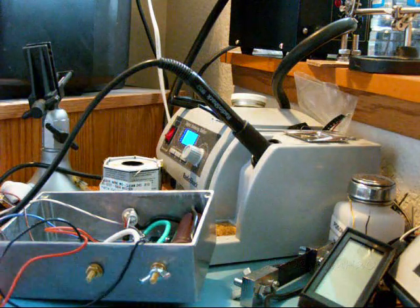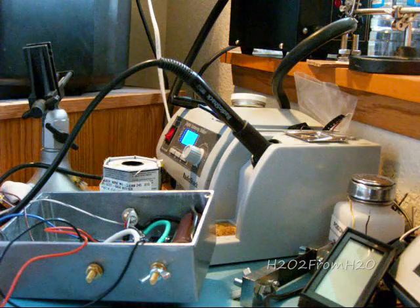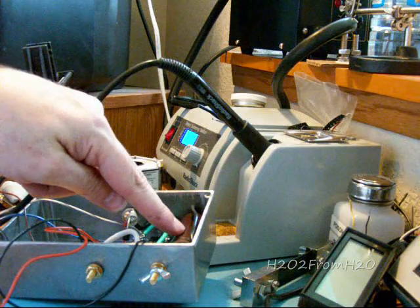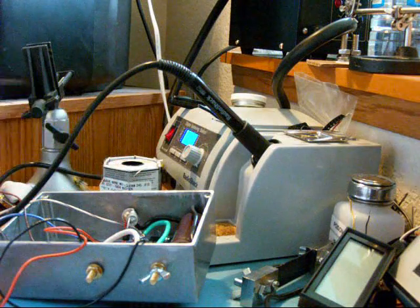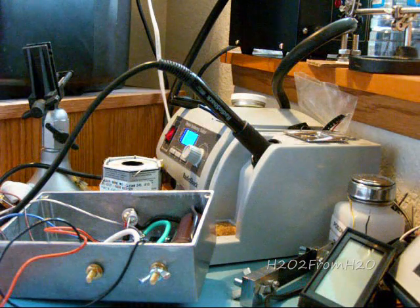Even on the wires, it's wicked up the wires — that's a good sign that it's hot enough. And remember that the piece that connects over here to the C7 capacitor is one piece, so as long as you have it connected in one area to the terminal, you should be okay.